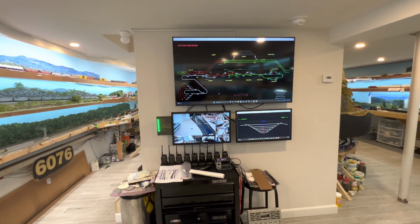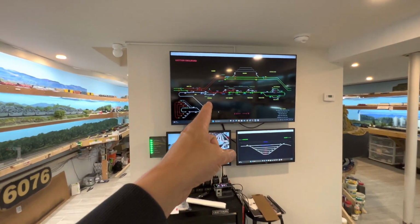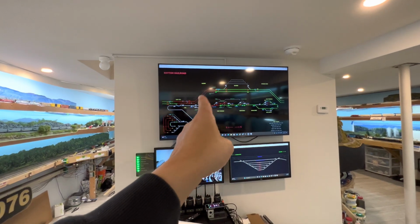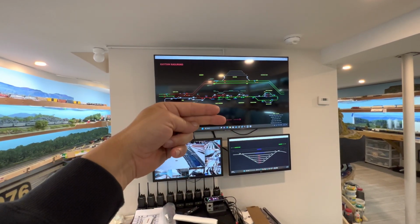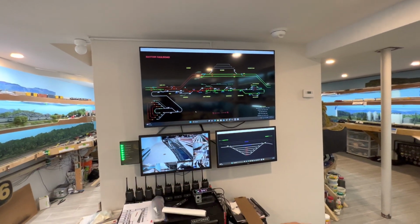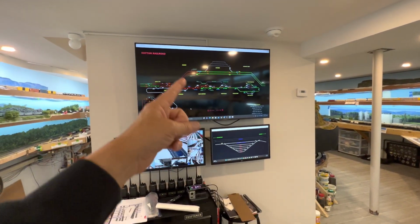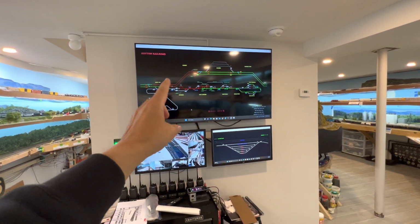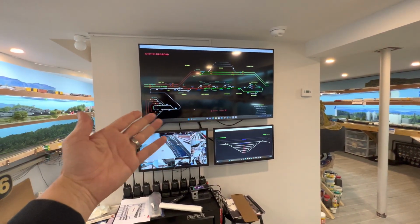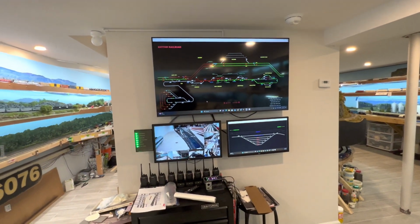And because I had to rearrange all that stuff, I also had to configure the CATS panel, because now the addresses, I had to move some wires from one zone to another zone in the actual board, which then caused not a conflict, but the wrong section to be highlighted when it was actually a different section.